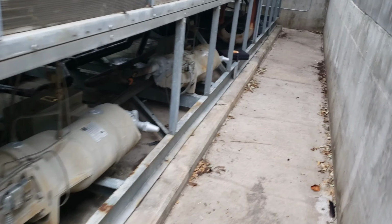We just staged up on condenser fans, so we're building head pressure. Just trying to keep the head pressure down. That's the starting amps. And there we go. So right there, now that we're at 45, we should be backing off significantly. So we're at 45 on leaving. It's got to come down more than that. That's not enough. All right, let me put some hands on. I'll check back in.